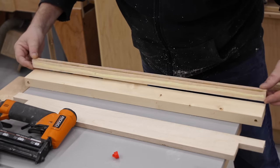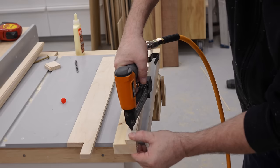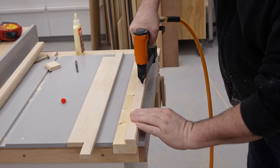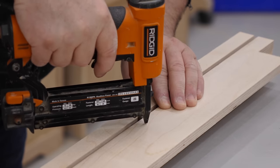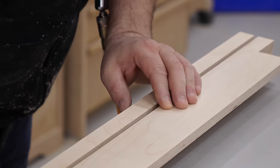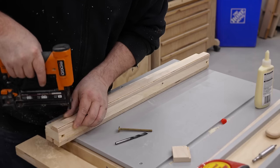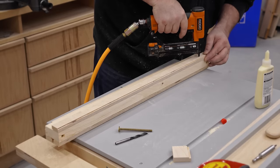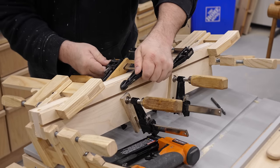I've got the sub fence and I made mine from pine, although you can use two layers of half-inch plywood. I'm going to glue the face parts to that, starting with the ones on the tall side. I'm driving in pins to keep the parts lined up, and I'm also checking the space between the parts to make sure that the quarter-inch T-bolt fits in there. I did the same for the short side, got it clamped up, and set it aside to dry.